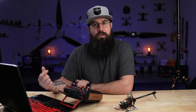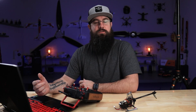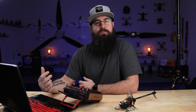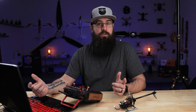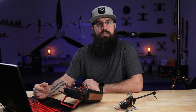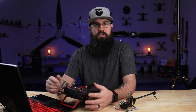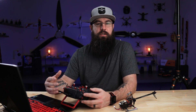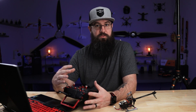The biggest difference with this video is we sat down with Jonas from Mac URC — links in the description. Jonas is a very smart guy and there's a 30-minute video where we go over every single detail of this setup. A key feature: around center stick the OMP M1 and M2 have a deadband, but Jonas's setup compensates for that and removes it, giving you a really precise, crispy feel.